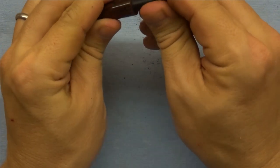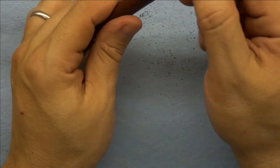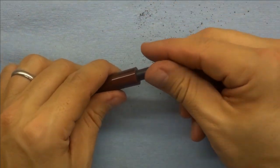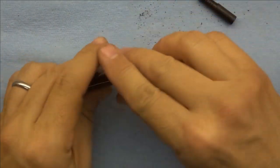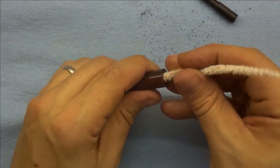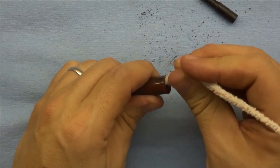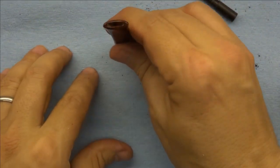Clamping on this is not going to be necessary. It's a very tight fit, and there's an airway straight through, so we're not going to get any pressure build up when I put them together. So I think we're going to be just fine. Thought I had gotten all that out. I think we're going to be just fine with just letting the epoxy sit.